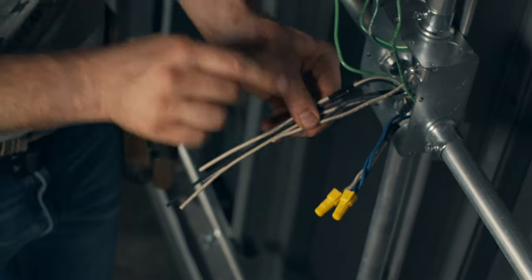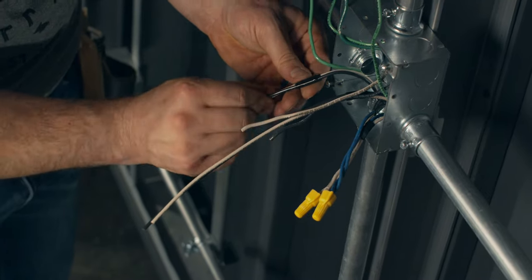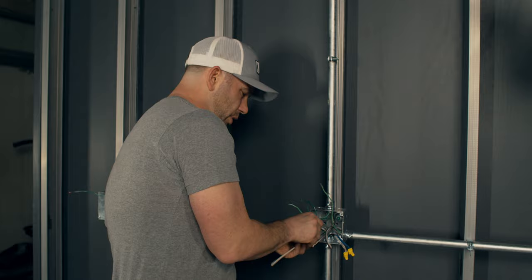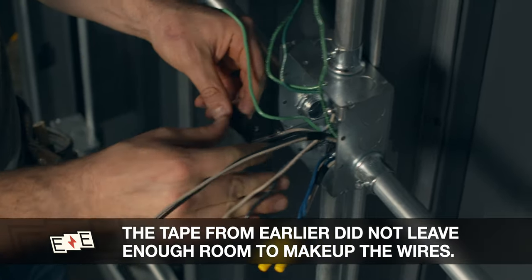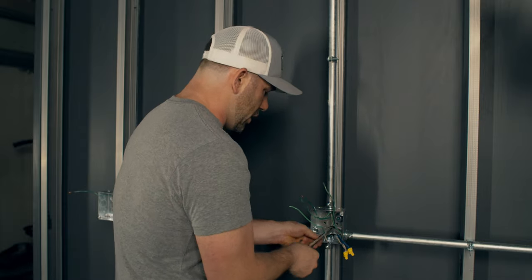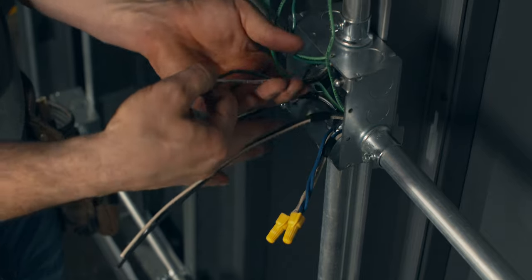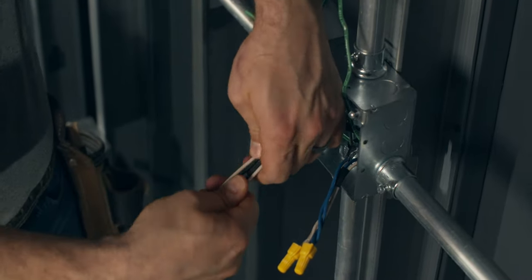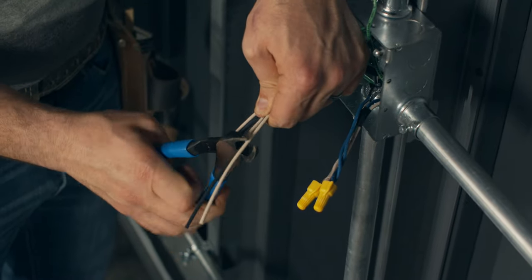Now, three wires. See how this wire is taped a little further up than where it's identified? That can be a problem — we might need to rip that off, because when you're trying to twist your wires, you need more flexible room. You want to identify them because somebody else might get into this box later and not know as much as you. So take the time to make life easier on the person behind you. Line them up like last time — the shortest wire is here but it's still enough. Too many wires for the strippers, so cut them with your dykes — diagonal cutters.